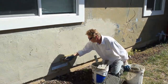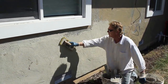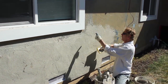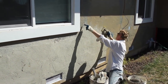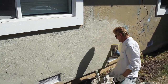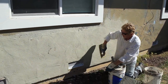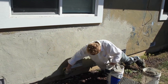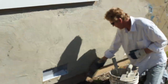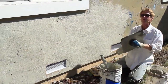If I wanted to match any of the finishes they've got currently, I can do that blindfolded — just bring out the sand aggregate. Notice I just put this on, and now we float it. This is what they did on this side — put it on, then floated it. You can see the sand on the base coat. By the way, the guys who did this are 10 times better than the butchers who did what I'm correcting right here — those guys should be ashamed of themselves.